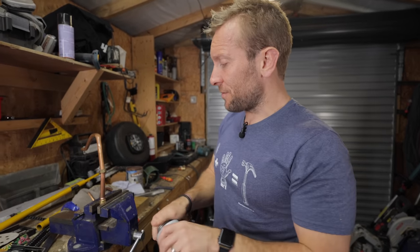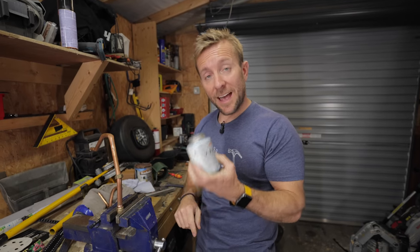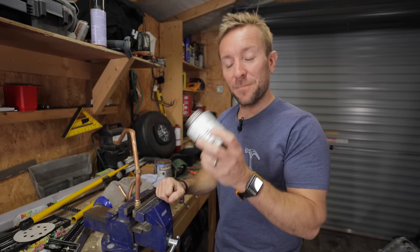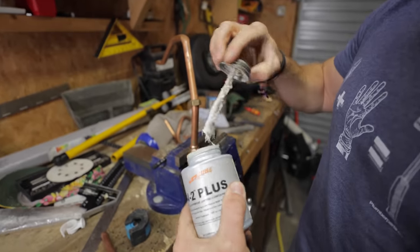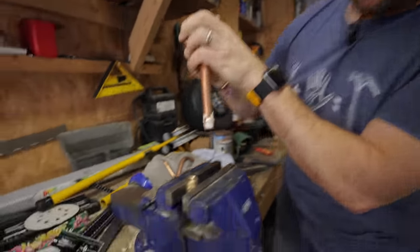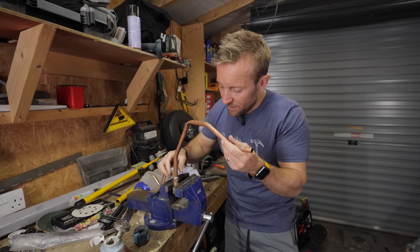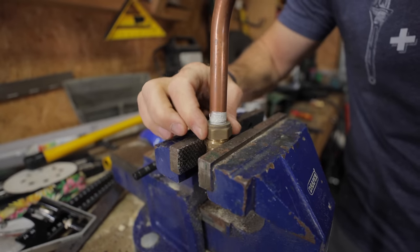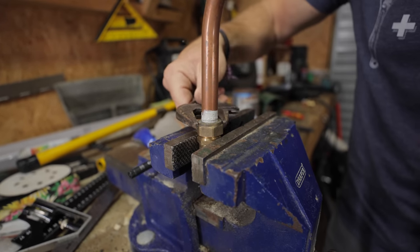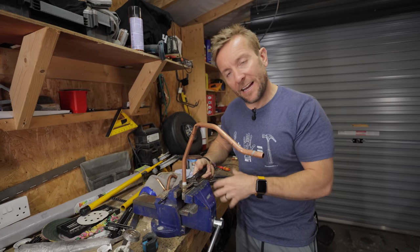I love to use a little bit of lube. We've got some here — this is Jet Lube V2 Plus, a multipurpose jointing compound. Also make sure that it's okay for potable water, and if you're doing this on gas, make sure it works on gas as well. You paint it on like that, and when I push this into the fitting, you'll see straight away why it's such a good idea. Look at it. That will set as a nice hard paste, so if you've slightly under-tightened it, it will give you a good seal. It's now on the shoulders of our olive, so when we tighten it up, you'll find it goes up smooth. That is exactly what you want — smooth, nice and firm, but not having to really force it to tighten up.